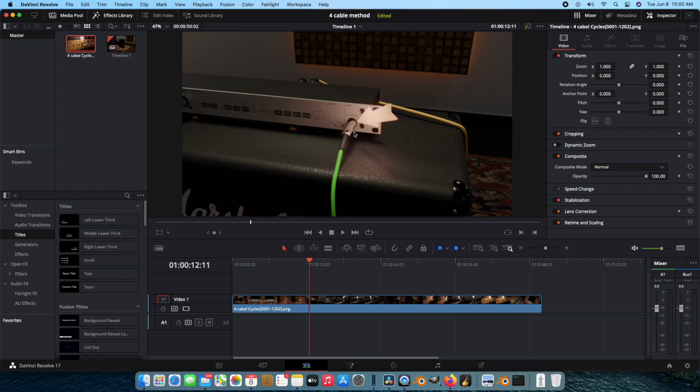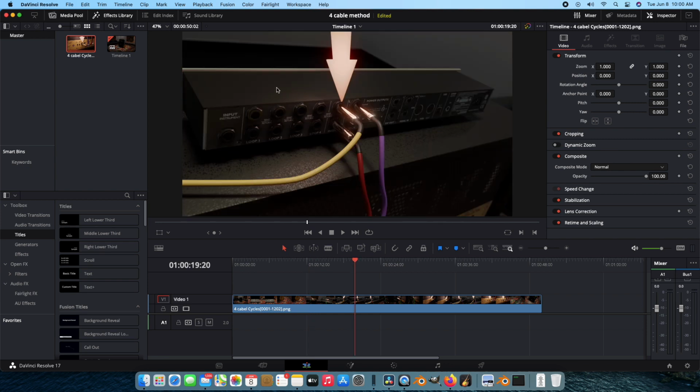So your signal comes into this unit and passes through these effects, providing that you're using them. If not, they're bypassed. Then initially it goes into an AD converter, analog to digital, runs through these effects if you're using them, and then is converted to analog again and is run through these loops if there's anything in the loops.